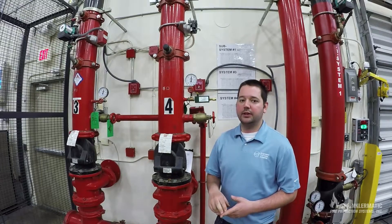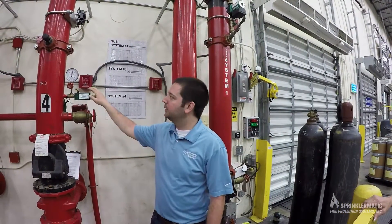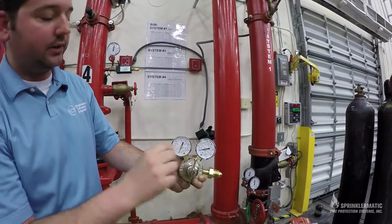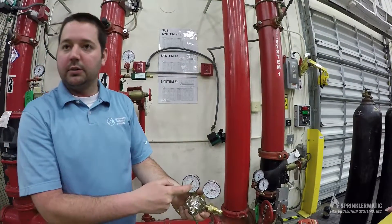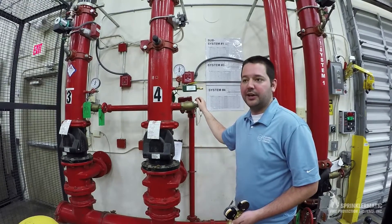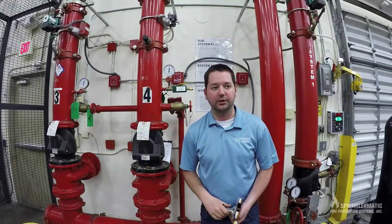If you need to come and perform maintenance on the system — anything that requires a full drain-down — the way you're going to do it is as follows. You're going to hook up your hose from your tank to your injection port as before, and inject nitrogen at a pressure higher than system pressure. Our system right now is at about 160 pounds, so we would adjust the regulator up to 170. Once we get to 170, open the valve and start injecting nitrogen. Once we hear nitrogen flowing into the system, open the main drain and let nitrogen flow the entire time you are draining. Keep flowing nitrogen until all the water is out, at which point you can perform your maintenance and return the system to operating service with no additional steps.